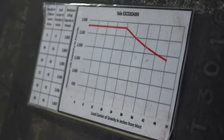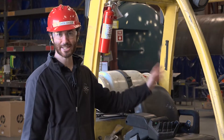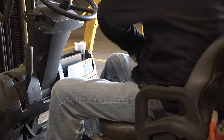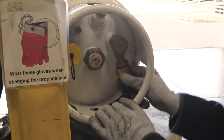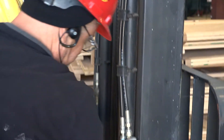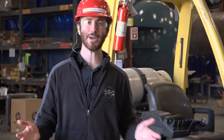There's a derating scale provided on every forklift. Also, check the tires for damage, check that the horn works, check that the seat belt is functional, check that the brakes and the lights are working, check that the propane tank is installed properly, and do a visual inspection of the hoses and the chains for damage. If your forklift passes that basic inspection, you're good to go and the forklift is safe to use.